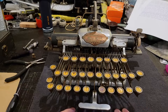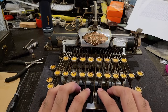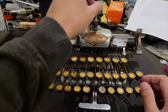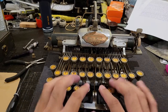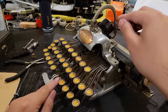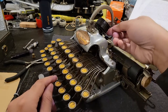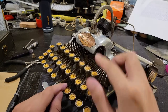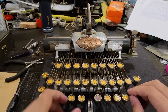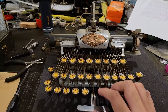Now, from that, you would have seen that thanks to this special optimized layout, most of the typing would occur on your bottom home row, eventually progressing upwards to your second and finally your third row for the least common characters. And basically, in addition to reducing the need for moving your fingers, it also optimizes the amount by which this type cylinder has to move. So from the least being the E character, which is already just on this side of the cylinder, versus, say, the J, which would be on this side, where it has to make an almost 180 degree rotation.